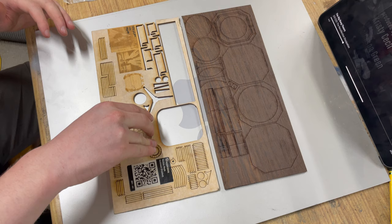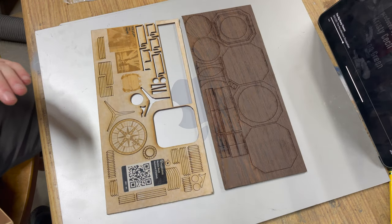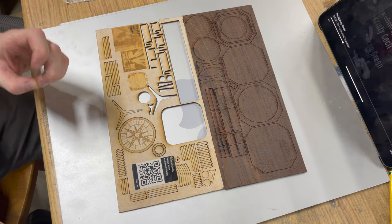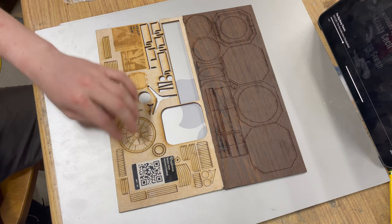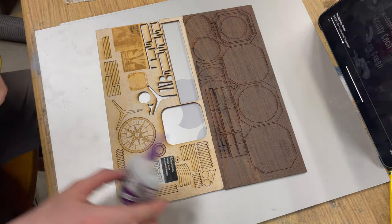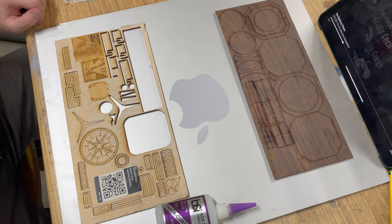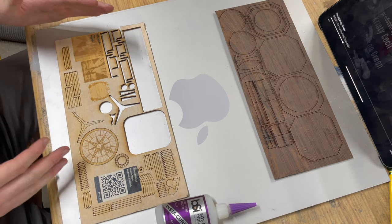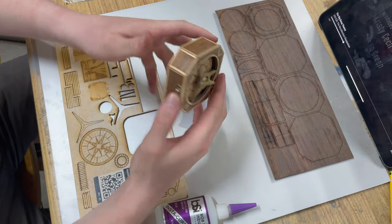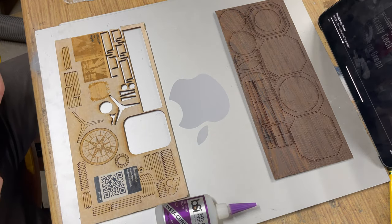Everything came out really good except for the compass rose, which turned out not as dark as I would have liked - I had the speed a little fast. You can see on my old one it's a lot darker. So I'm going to redo just this piece. Luckily I do have some proof grade maple plywood, and because for this piece all that matters is the face, I can redo it in plywood - a nice veneered plywood. All these pieces will be glued together with just plain super glue. I've got a piece of aluminum from an old Mac and super glue doesn't stick to it very well, so I can lay everything down on here and pop it off later. I'm just gonna start assembling - cue the time-lapse and listen to some cool music.